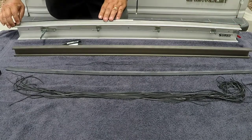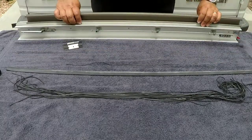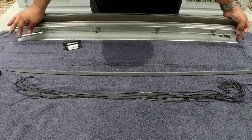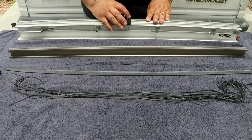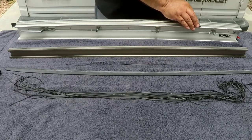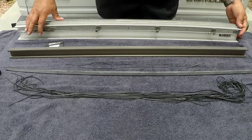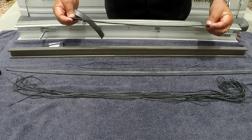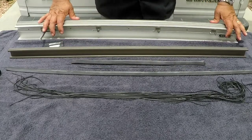Put this one here. Close it up. Level stop — put it here on top. Palms of your hands, press firmly. Finger on the red lever, pull up — same time open it up and close it. Ready to cut. Grab your trimmer — same thing. Start cutting, grab a hold of that rubber, keep pulling up as you go across. There it is — you just cut the rubber again. Open it up, and there you have it: nice cut squeegee rubbers ready to go to work. Okay, take it easy.